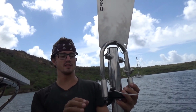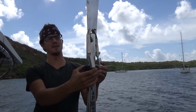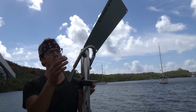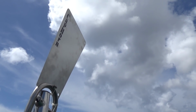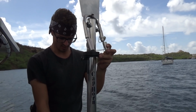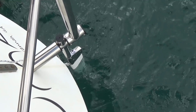Okay, so the theory is you rotate this whole top piece into the wind so that this stands up and down. That's when you're on your right point of sail. Then this will fall over, the wind's pushing on this side until it comes back around, or if it's the other way, it'll push it this way. And that motion of it swinging back and forth relays the message down through here to the servo in the water. And it turns it ever so slightly. It doesn't need much.